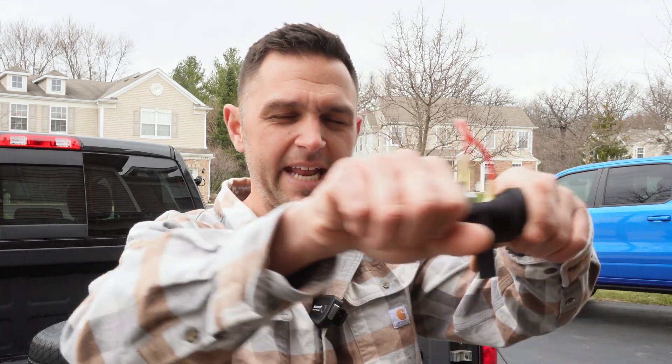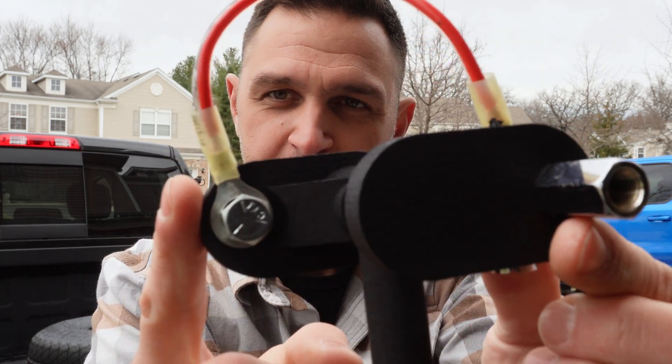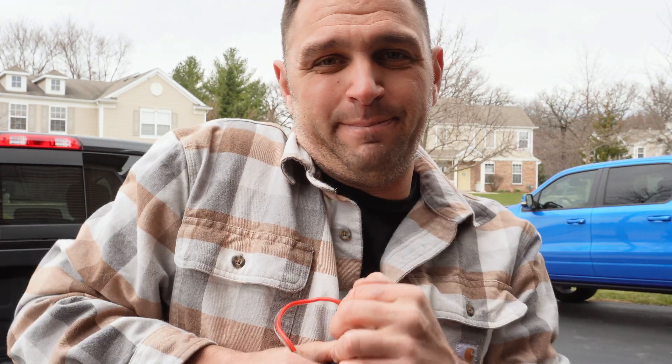Now with PETG, it felt durable, but I know there's a breaking point and I could actually see the PETG bending at a certain point. It's not necessarily something you'd want to hoist in the air with a dipole. The goal of this dipole was really hamsticks, but also telescoping poles. What I found was, as I extended the telescoping pole out, more weight away from the center piece means more of a bend and more stress on this center conductor here. The best thing we can do now is recognize that nylon — or PA-12 — which is what this was printed in, is very durable. I can't seem to bend it or get it to want to break. Let's go put it up on a pole and put it in the air.